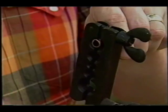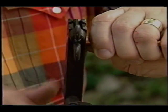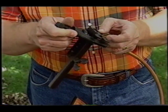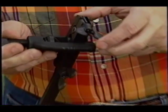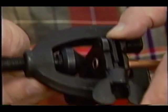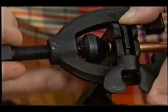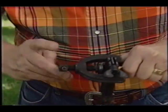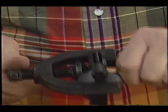The next step is to simply tighten these thumb screws to clamp the piece of tubing in the flaring tool. Attach the final part of the flaring tool that actually creates the flare, and you can see the cone tip fits down inside the copper tubing. The final part is this simple little handle that slides into the end of the conical part so that you can actually start to turn and flare the end of that copper.